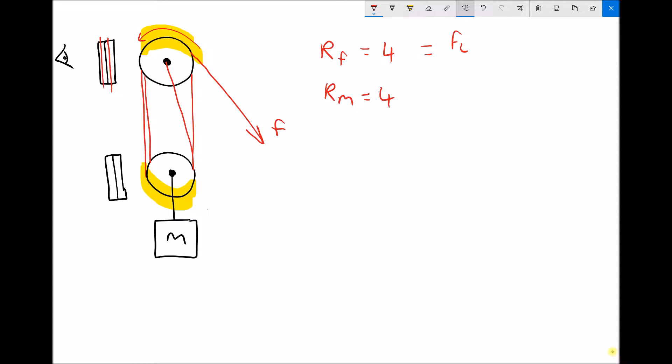With a force ratio of four, the weight of the object over the force applied equals four, and the distance travelled by the applied force over the distance travelled by the load also equals four. Calculations with pulleys are relatively straightforward once you understand that the tension in the cable means we multiply the forces acting upward in the system.